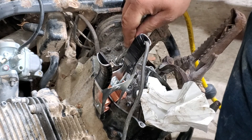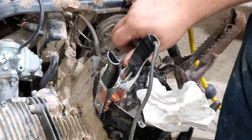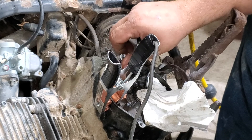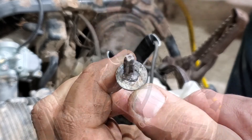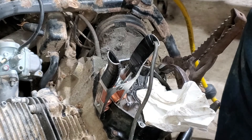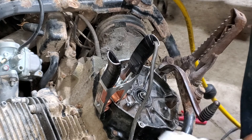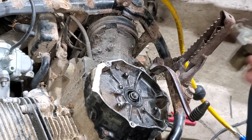Is it actually coming out or is it just twisting the thing off? Is it too hot to touch? Nope - look at that, I got it! It's out! Okay, so - don't use a drill with a tap and die. I just wanted to make sure I got all the threads and went a little too deep, and that was it. That's always my biggest fear when doing that kind of stuff.